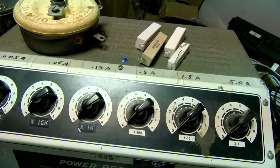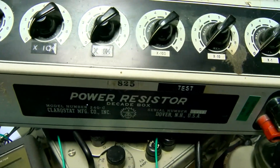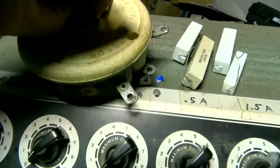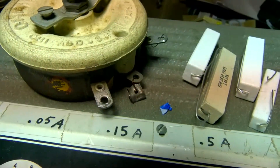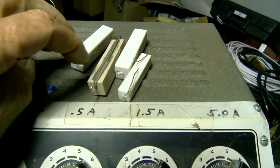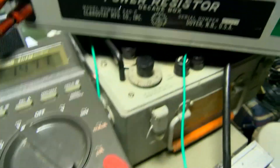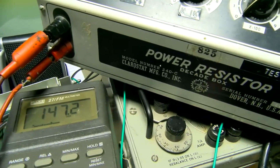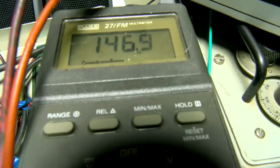There are three ways to figure out the resistor value. You can use a power resistor decade box, which is what I'm going to use. You can find one of these big 100-watt 100-ohm variable pots if you do a lot of radios. Or you can have a collection of fixed resistors and do the substitution game. I have the decade box inserted in series between the diode and the capacitor, and I'll simply dial in the value I want.